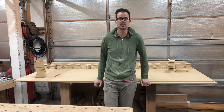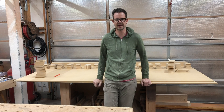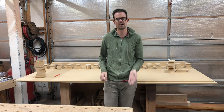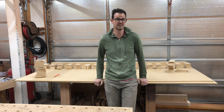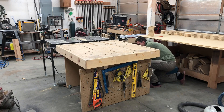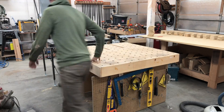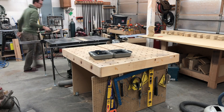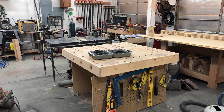When I made this torsion box it overhung a little bit on the edge, so there's a slight roll-off right on the side. I think depending on your material it's probably worth trying it with three pieces on two edges and one in the middle. I'm going to level the torsion box to the table saw and use a laser just to get everything flat with gravity — that's an easy way I generally like to make sure things are parallel with each other.